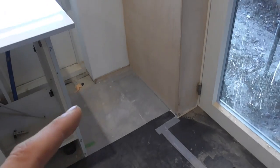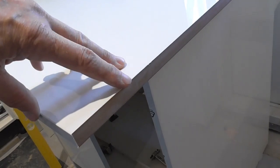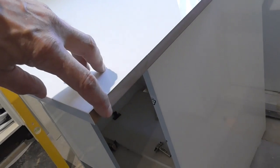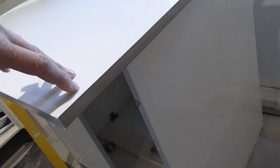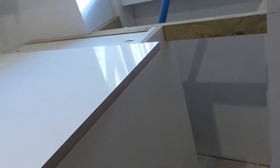If the floor is a long way out and you can't do that, obviously you may well have your MDF raw edge exposed. It's really important if you do put this down to the floor that you put some PVA along the bottom edge to stop any moisture getting in. I would usually use a waterproof PVA and put at least two coats along there.